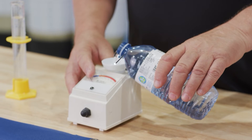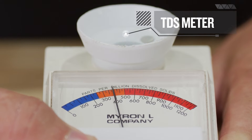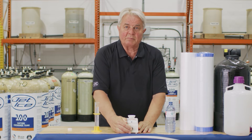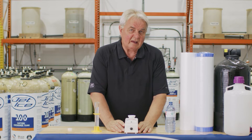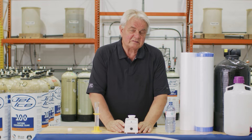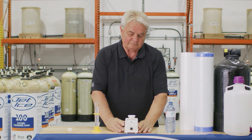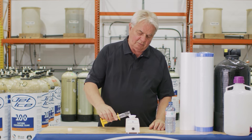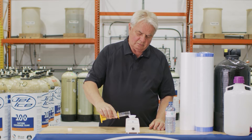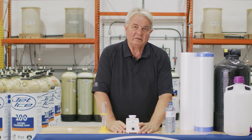It's really quite simple — we do a measurement test on water quality. This is showing over about 370 parts per million, which is fairly hard water. People fail to understand that when you're making ice, you're only freezing the water. The mineral content doesn't freeze; it has a tendency to saturate out on the surface of the ice and give you a greasy film. Whereas if you take relatively clean water with all the minerals removed, your TDS is near zero — and that near-zero reading will give you a great quality sheet of ice. Great water, great ice.